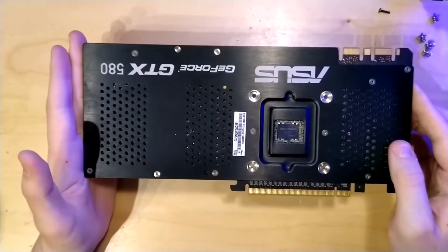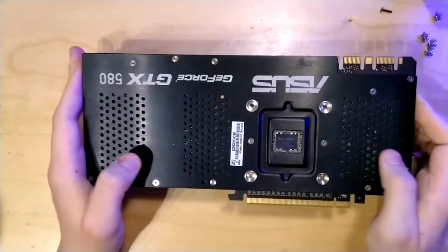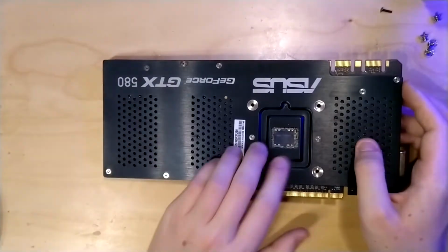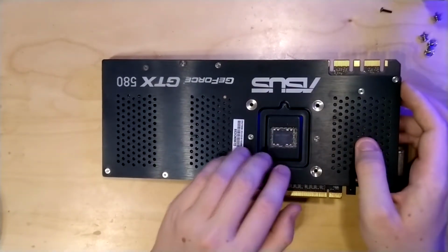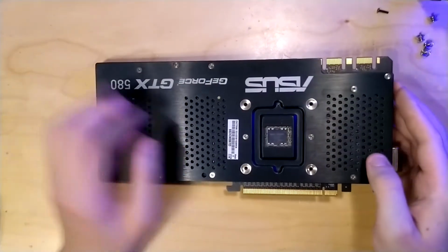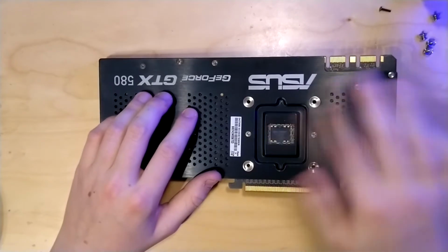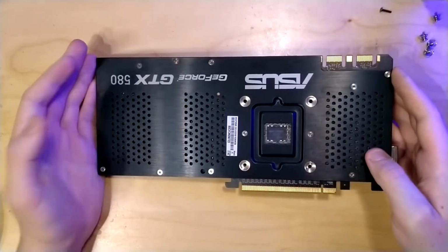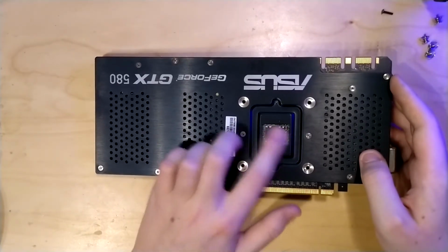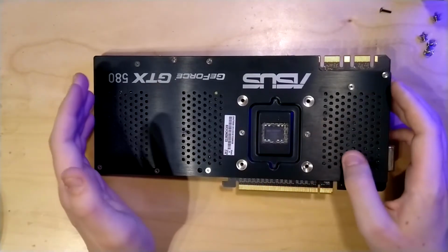And this Proadlizer capacitor is just like every other capacitor, just that it is very expensive, very large, and it has a very good frequency filtering response across the whole frequency spectrum. So basically what these capacitors you find on the backs of GPUs are for is, depending on their size, they are good for filtering certain frequencies, like switching noise caused by the VRM. And companies put these capacitors back there to filter all the switching noise, and what ASUS chose to do here is replace all these smaller capacitors by this big one, which has really good frequency response across the whole spectrum.